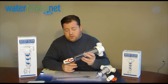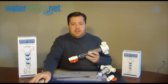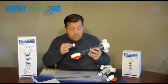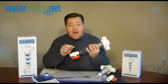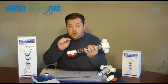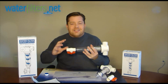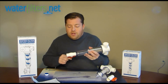There's an important thing — we've had a number of calls about broken valves, and the reason is folks aren't following the instructions. Every box comes with instructions, and they specifically state that you're supposed to use Teflon tape on the threads, and then screw the valve on leaving some threads remaining visible. If you crank this valve all the way down so you cannot see any threads, it's very likely the valve is going to crack. I wish they hadn't designed it that way, but the instructions say so — leave some threads remaining visible and you won't have to worry about it.